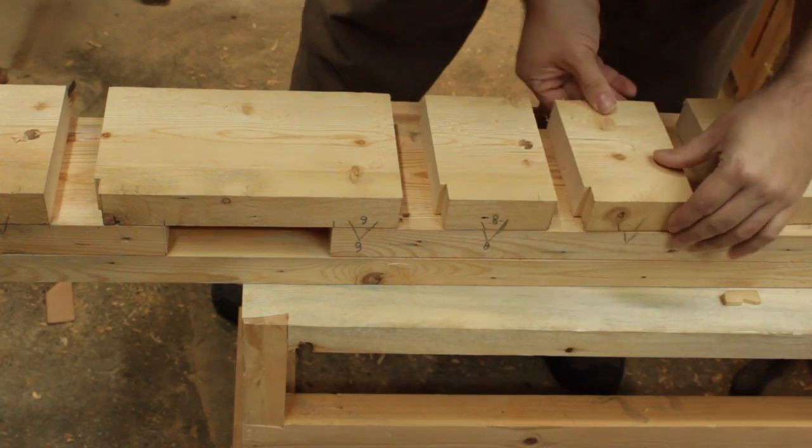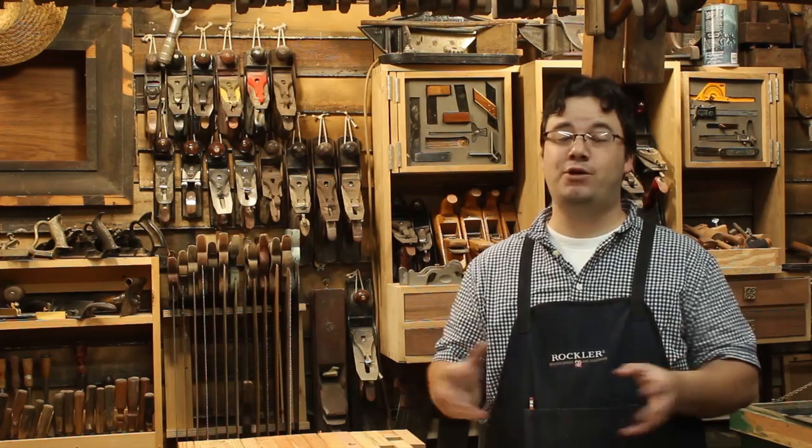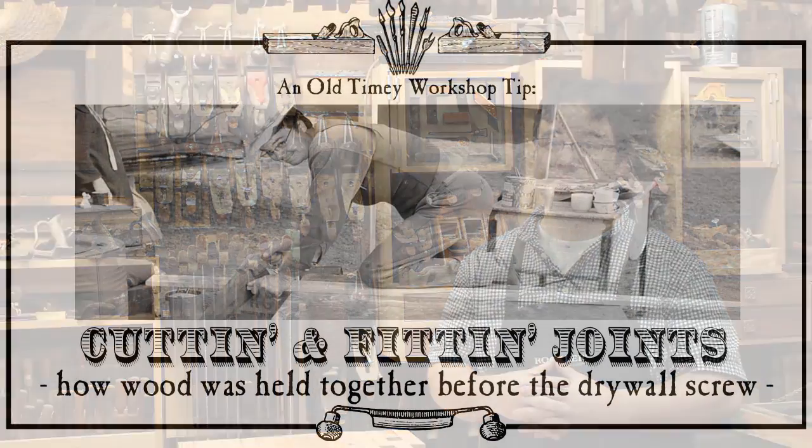And since we're laminating our top together, we don't have to chop mortises anyway. We just cut out our dog holes before we glue our bench top up. Plus, square holes make your bench look more professional. People who see it will think you actually know what you're doing.